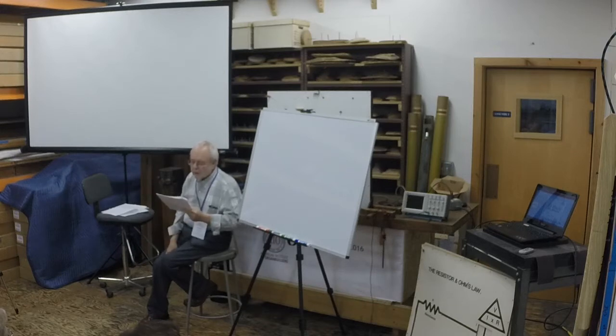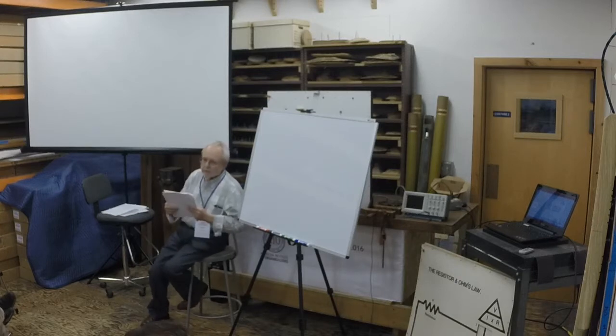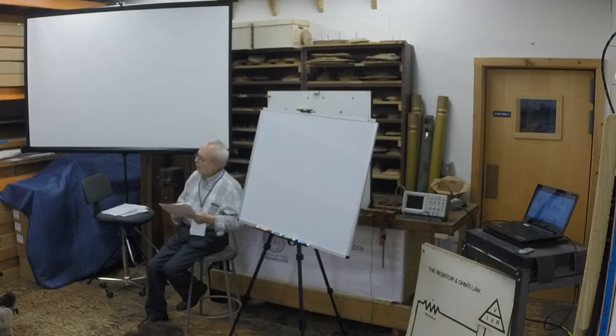Power supplies are normally rated by the DC output voltage and current. However, this current is almost always specified at a fixed voltage, say 12 volts, or in the case of the power supplies we generally buy, 13.8 volts, which is the voltage at which you would charge a lead acid battery.